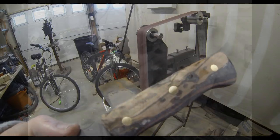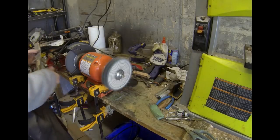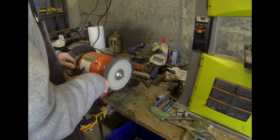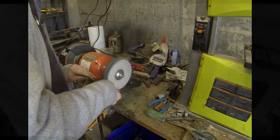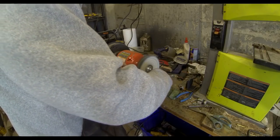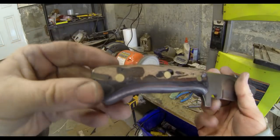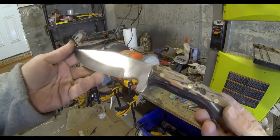I sanded down the brass pins, finished sanding the scales, and sanded down and then polished the blade — so really nothing is left of the glass bead finish. I then brought it to the buffing wheel, buffed the blade, and also buffed those hybrid micarta scales. I was really happy with the way the scales came out, especially after spending a few minutes buffing them. It really brings out a nice shine, and the characteristic of the wood combined with the black and the brown micarta gives a very interesting rustic look.